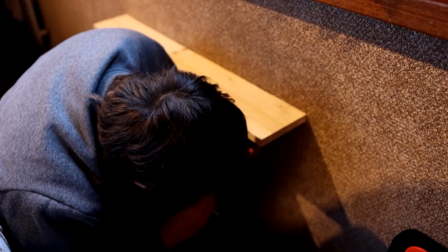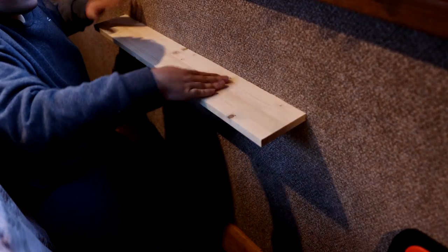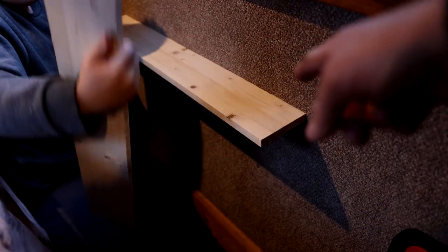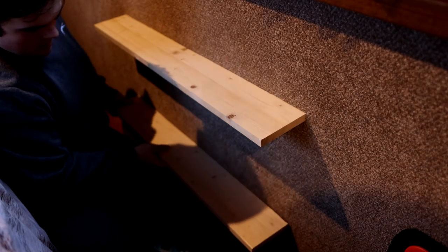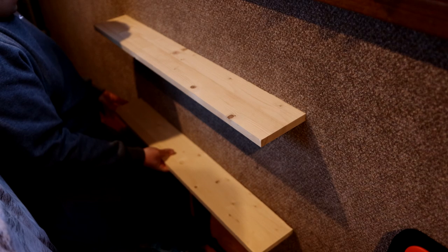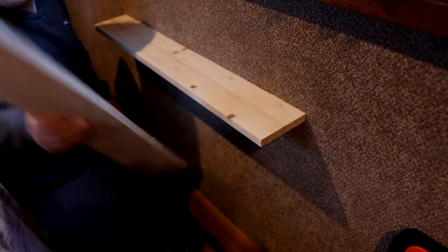When we varnish it, we'll put some varnish on it tomorrow, yeah? Is it solid enough? Feel good? Shelf number one is in. Feels better than Mum's, doesn't it? Yeah. Solid. Just hope Mum doesn't walk into one of them corners. We could always take them out tomorrow, the corners, with the jigsaw. We're going to varnish it in the morning, because if you do it late at night, the fumes, you'll be breathing it in all night. And then I can put more shoes underneath as well. We're going to varnish it, leave it a day, sand it back, and give it another coat.